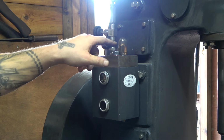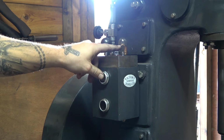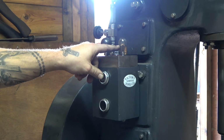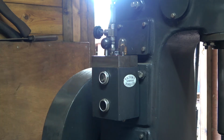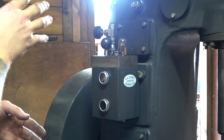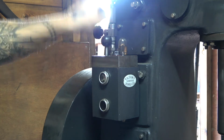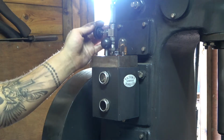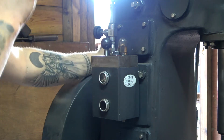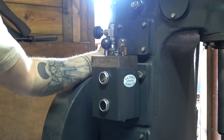What's supposed to happen is this glass tube up here is not supposed to have oil in it constantly. It's supposed to drip through in the little copper pipe that you can't see in there anymore because it's full of oil, and then you go off your drips per minute, or drips every 8 seconds I think it is. If you read the manual it will say. But I can't see that anymore because it's spun and it's filled up. This pump doesn't work anymore, so I've given up with it completely. What I do is I open up the tap, and then what I showed you on the other side with the clamp down feature, if you open that up it will cycle enough air through it to draw the oil into the hammer, and then it works anyway.